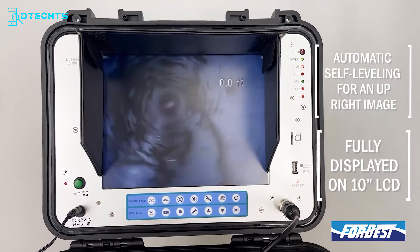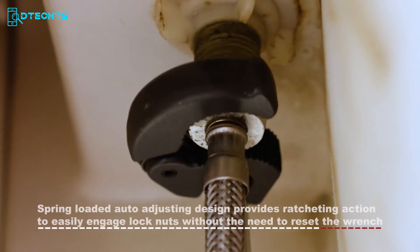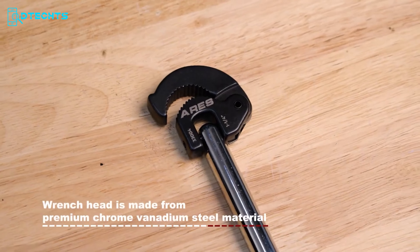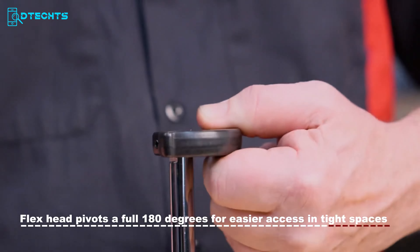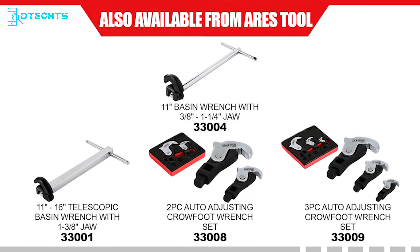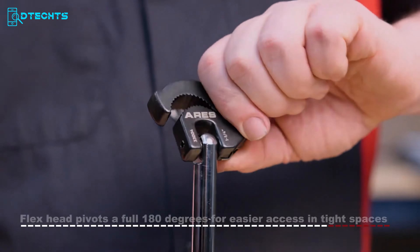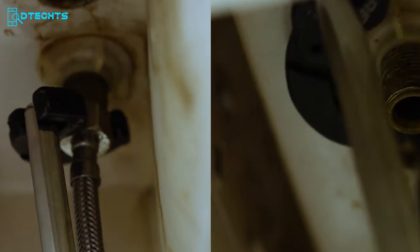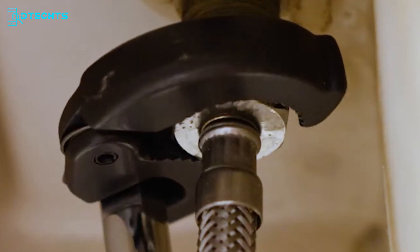The ARE's Tool 33004 Basin Wrench is a great solution for any plumber or DIY enthusiast. The wrench features a slim but strong chrome vanadium steel shaft, making it perfect for accessing hard-to-reach spaces. Thanks to automatically adjusting forged steel jaws that can handle nuts ranging from three-eighths to one and a quarter inch, you'll always get the right size for the job. The 33004 has a flexible head that pivots up to 180 degrees, making it incredibly adjustable for working around obstacles. It also covers a wide range of under-sink jobs including supply lines, valves, drains, and faucets.